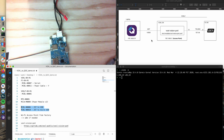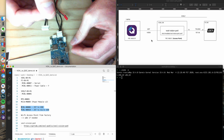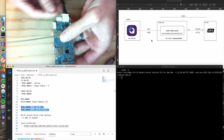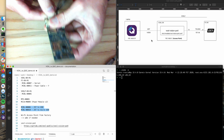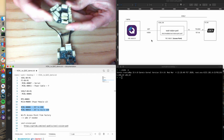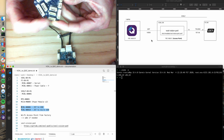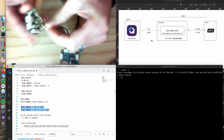Then I grab the serial cable, and it's symmetrical. It comes in the flight core development kit. These little 6-pin, I call them Hirose, 3-wire. So I'm going to plug it into the front port, which is J12. And then on the flight core, there's a J1, which is a 6-pin mating connector there. So we'll plug it into there.